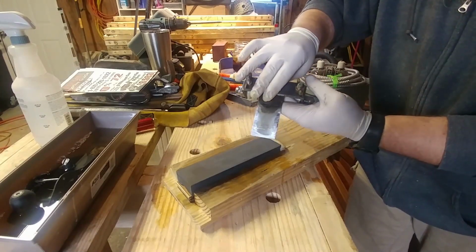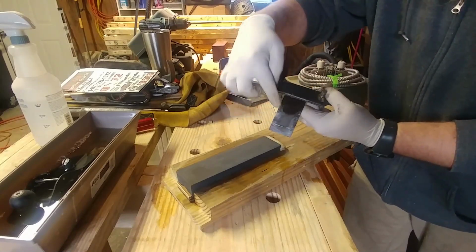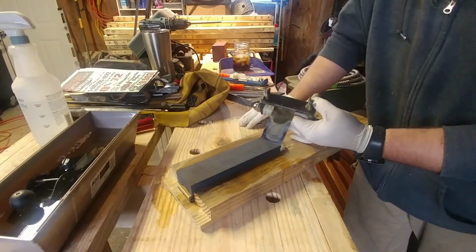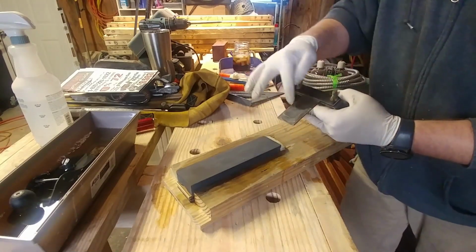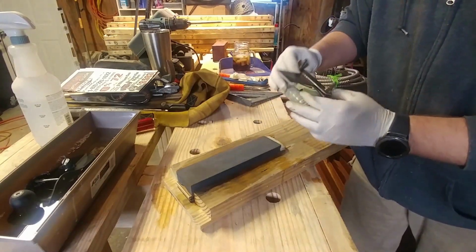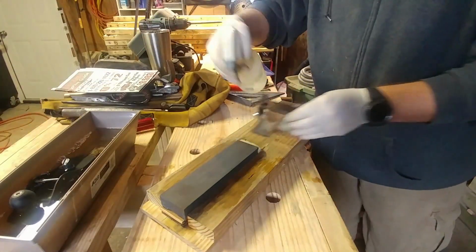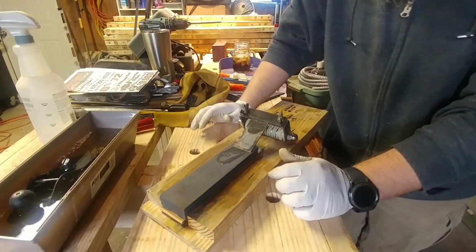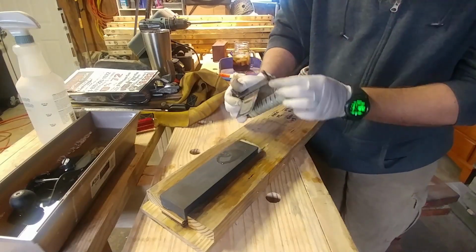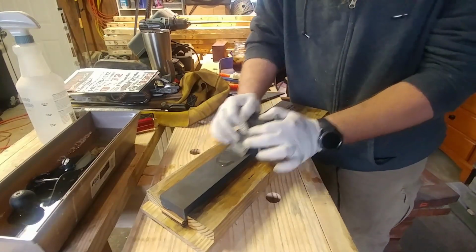And you can even see on the back side, like when you saw me flattening it, I have the nice little U shape or horseshoe. This means that it's cupped in the middle from when they made it. So I went ahead and flattened it out. That's really all you need, up to the edge. That'll last me quite a while. And then from here, I'm establishing that main bevel, which should be right around 25 degrees. I did check it with a bevel gauge.